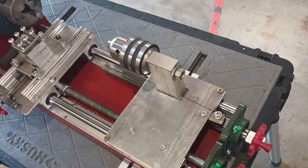From the initial tests, it appeared capable of cutting most common materials, yet it still left a terrible surface finish — especially bad with mild steel and copper. It turned out that the chuck plate wasn't bolted on tightly enough, and the secondary slide was able to wiggle in multiple directions.